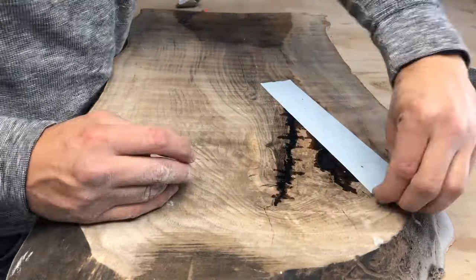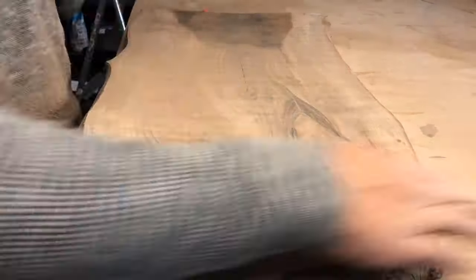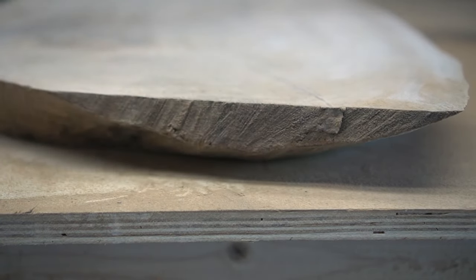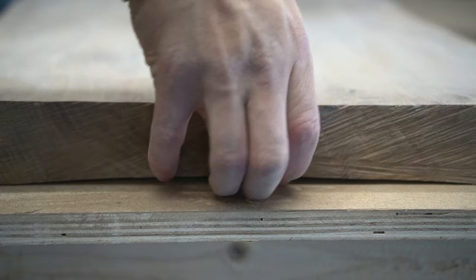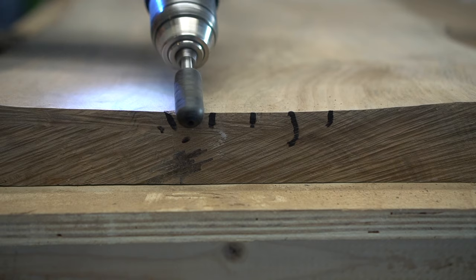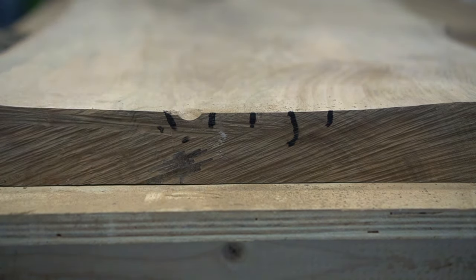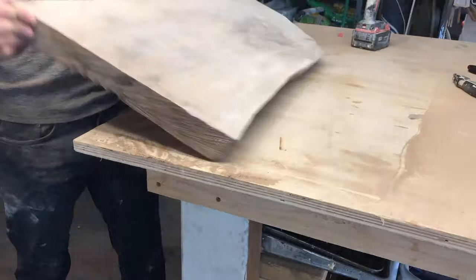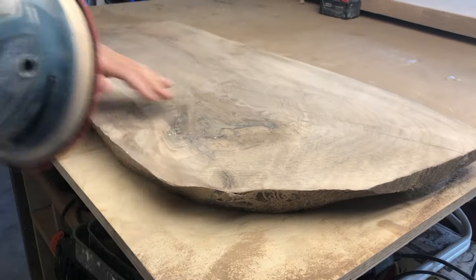I remove the tape from the back side — it held on well but was quite close to seeping out, so make sure there's enough pressure and adhesion. I'm making this into a charcuterie board or serving tray, and one issue is that one side is easy to grasp but the other is not. So I'm digging finger holds into the bottom of the tray using my drill and a Bosch rotary rasp — perfect little finger holds quickly and easily — adding stability and grip strength.